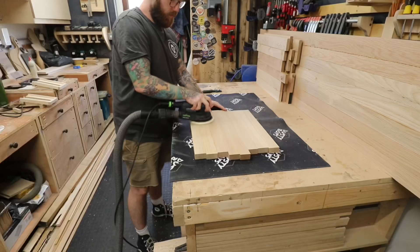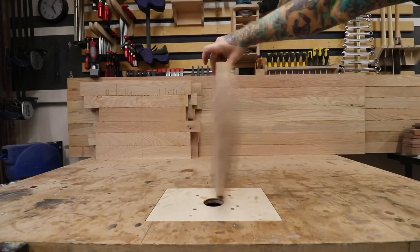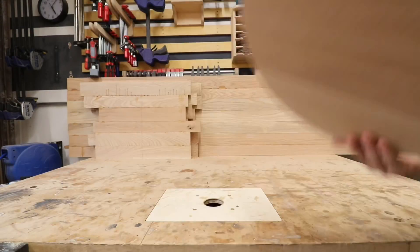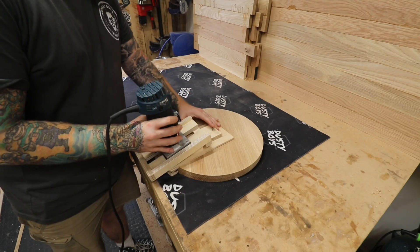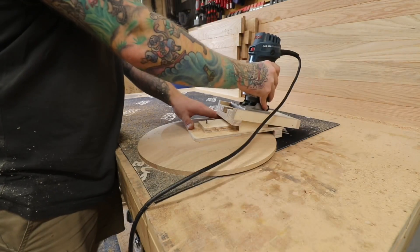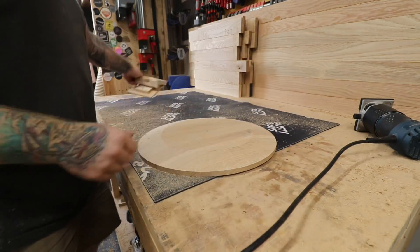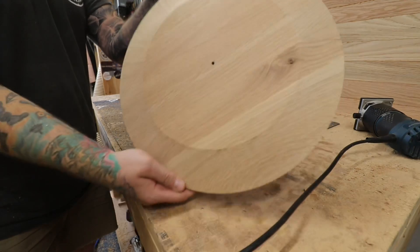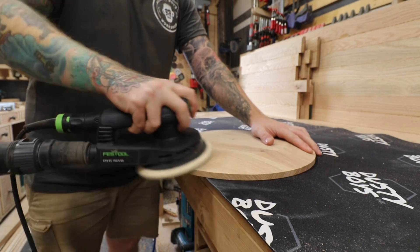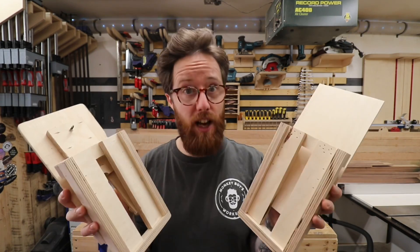And this is how it works — let me just make a quick circle. Simply install a flat bit in the router, go over your piece once, and yes, you'll cut through a section of your base-base, then keep lowering the bit until you've reached your desired chamfer detail. I'll use my original jig for this particular piece as I'll be setting up the new one we just made for a potential upcoming project. It's a really easy jig to make and in my opinion everyone should add it to their inventory of options. If you want to see the jig in action on an actual furniture build, click on this video here — I hope you enjoyed it, folks.